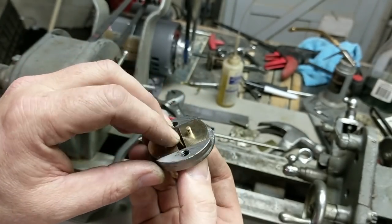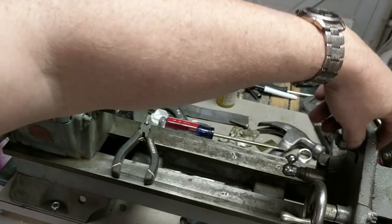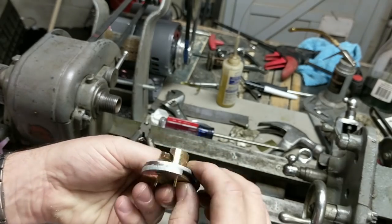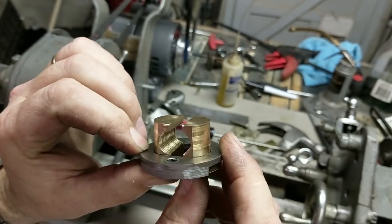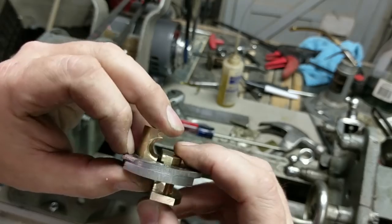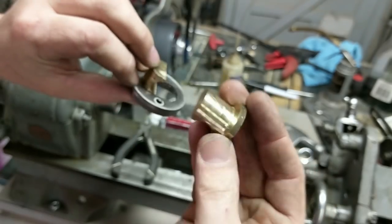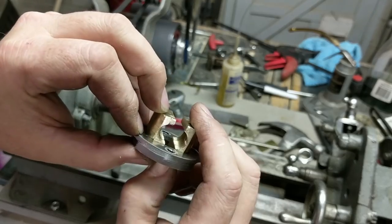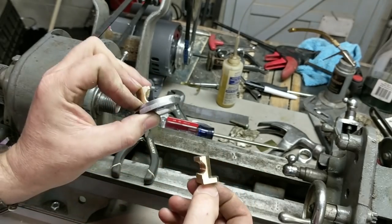There are the pins installed — brass pins, one-eighth inch. I've seen other people make them out of hardened steel dowel, but I would rather wear out the pin than the cam here in the unit. Giving it a test fit — it seems like it's all going to work except that it's not opening up quite wide enough. That's a function of the way I made it by turning this round instead of milling it flat — it's hitting right back here. So I'm going to file a flat edge in here to allow it to open up about a sixteenth of an inch farther, opening up some channels in the back, and then do final assembly.